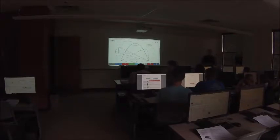Okay. Now, in reality, that's a little bit of an idealized model. There's always going to be some torque flowing through the motor because there's energy lost from friction and heat. So there's always going to be a little bit of current going through the motor, which is why we talked about free load current. However, generically speaking, that's what works. So basically, as the motor's turning, it's generating a force that's resisting electricity going into it. So the important thing to remember here is that at a particular voltage, current equals torque, okay? But the motion of the motor doesn't allow as much current to go through the motor at higher speeds. So that's why you see this behavior.